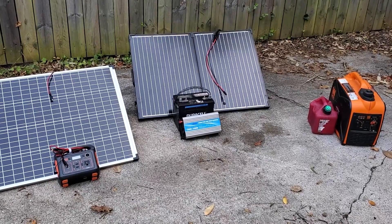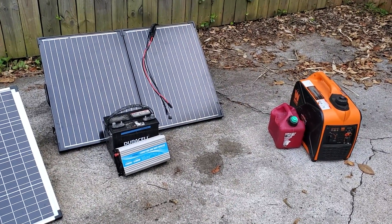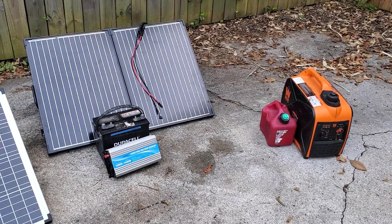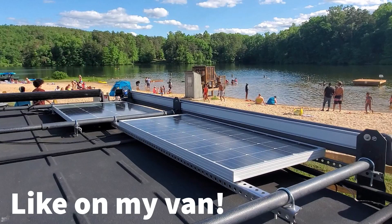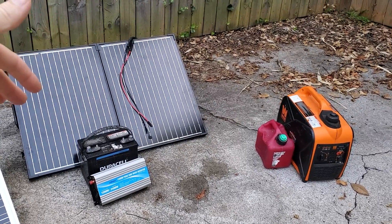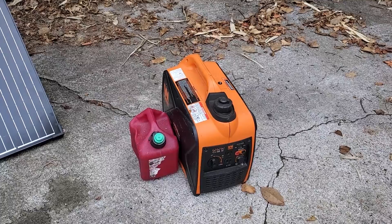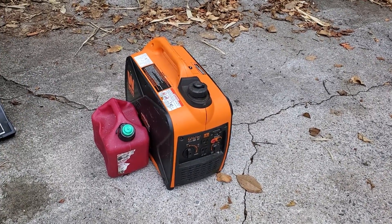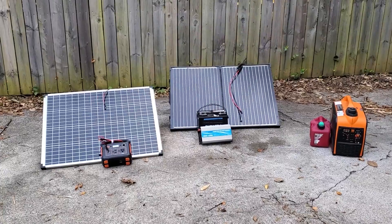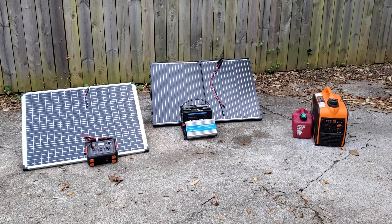I still carry my generator with my trailer when camping. To summarize: if you're doing light camping and just don't want to run down your car's battery, go with something like the Jackery unit. If you have a larger vehicle and want to permanently mount a secondary 12-volt system — especially with a trailer where you can put the panel in the sun — go with the DIY solar style. A basic 100-watt panel runs about $85–$100, pair it with an $80 battery and a $200 inverter. If noise isn't a concern, a gas generator is for you — you'll always have power as long as you have fuel, no cloudy-day worries.